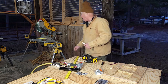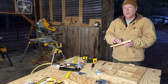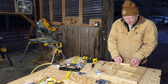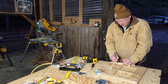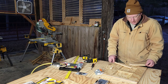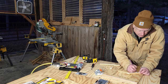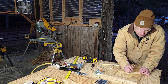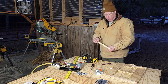So if you saw my earlier videos, this demonstration. All right, so the way I do this, again, I don't have to make a whole lot of measurements now that I've got my template set up. I just simply make my edge flush, and then trace my mark, put my mark on the bad side. Here's my new piece that I got to cut out, and it should be the same. And I forgot to say, because this is not my template, I'll mark this as template, and I'll say back, so I know which side it goes on, and I'll put Snelgrove at some point on there. All right, so I know which piece cut out now.